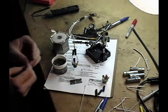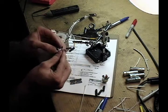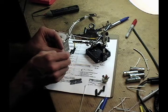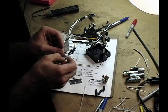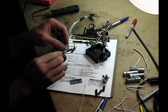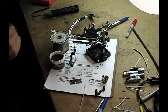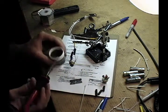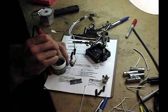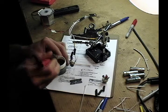I'm going to use a crude tool here, which is a little piece of shielding left over. I'm going to paste the flux all over the joint. The flux will boil off when we heat it up, leaving hopefully an oxide-free surface. I'll do this with the iron tip as well — I can just sink the iron in and get it clean.